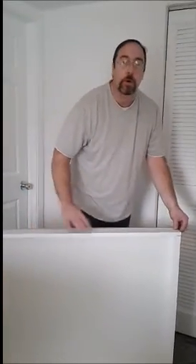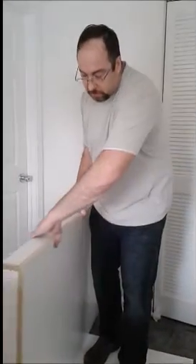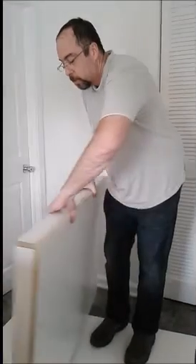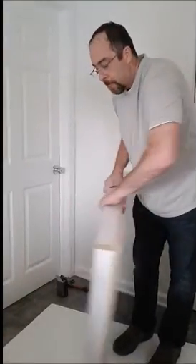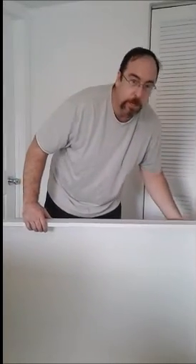I've nailed all four corners of the frame together and then nailed the frame to the plywood with finish nails. You might be thinking finish nails wouldn't hold as well as screws — that's true — but later during the project we'll be caulking the entire inside perimeter, which will seal it up and act kind of like liquid nails. The next step is cutting holes in the bottom for cool air ventilation and cutting a half circle out of the top for the heat to exit with the fan.